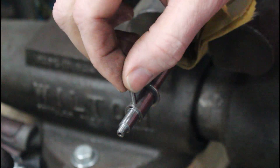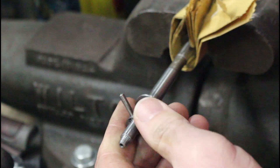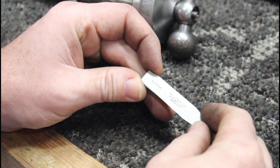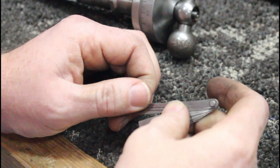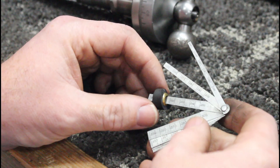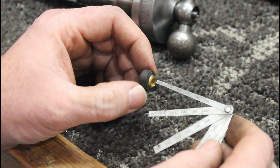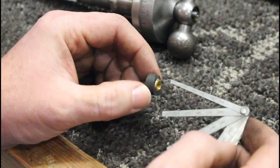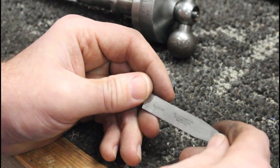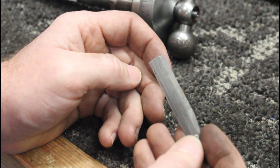This pin doesn't quite fit but it will work for now, so I'll cut that off. Here's a quick little tool I want to show you — a little measuring tool I used to figure out which side of the taper we were on. This is a Starrett No. 269A, a small taper gauge. Each of the little arms is tapered. When I measured that hole it went from 120 to 124, so I could figure out which side was the wide end and which was the narrow end. I found this in an old toolbox — it came in really handy for this job.